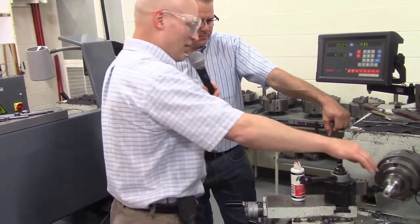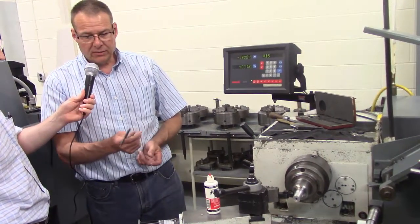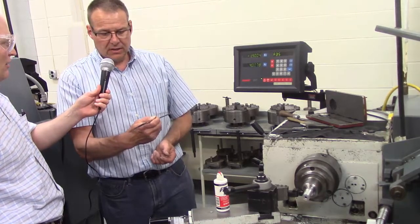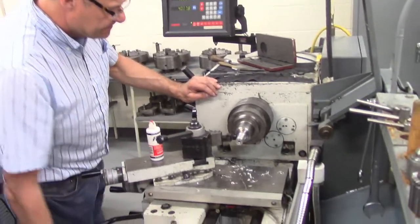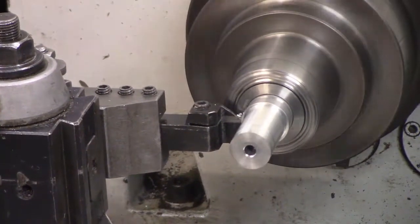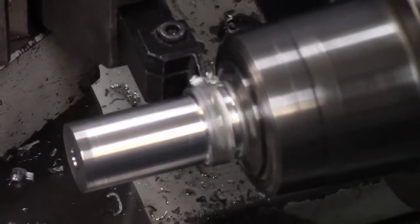When this starts cutting off, eventually the part is going to fall off and go flying. The nice thing about this part is it has a hole in it, so you could take a small piece of material in a drill chuck and let it sit in there to catch the part, or use an Allen key to catch it. At no time are you catching the part with your hand. Don uses manual cross feed rather than power feed, doing the cut very slowly at 110 RPMs.